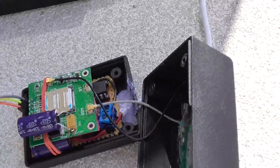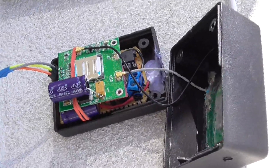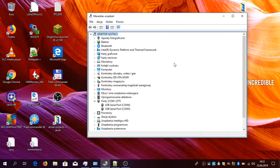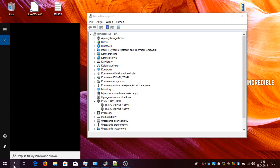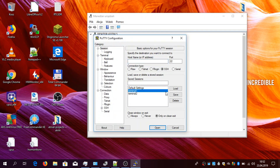Right now I'm switching to my laptop and I'll be recording the second part of this video from there. So I'm right behind my laptop, trying to show you something with the GPS tracker based on SIM808. I have a control panel, and those two serial converters I showed just before are now attached to virtual COM ports — COM number 4 and COM number 5. I'm launching PuTTY terminals to connect to the SIM808 and ATmega MCU.